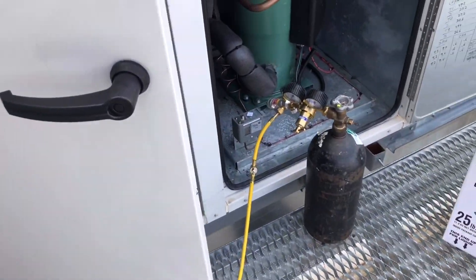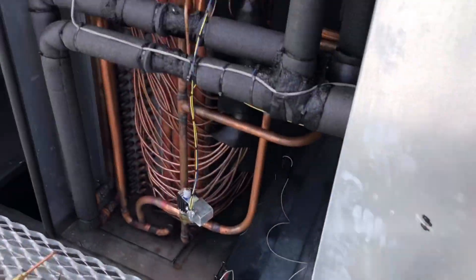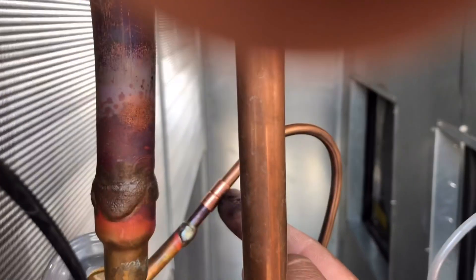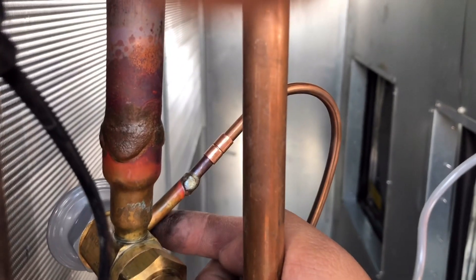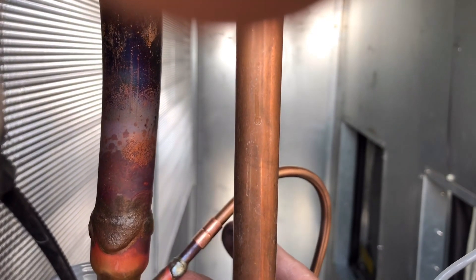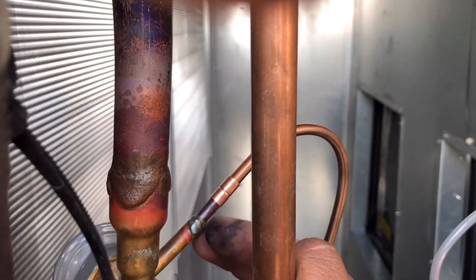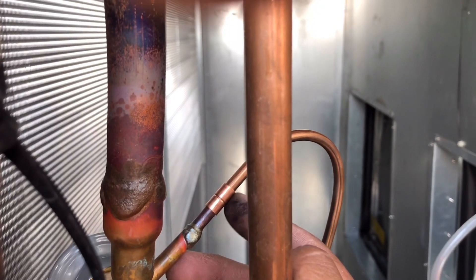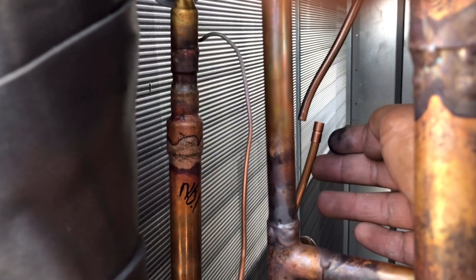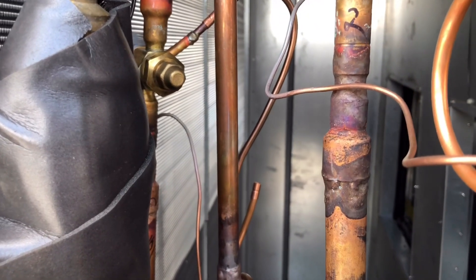Guys, we're back from United. Got all the stuff I needed, so we're ready to braze. We got the nitrogen flowing. I know some of y'all are going to be a little disappointed, but I am going to use a coupling right here because I don't want to mess with this valve. I'm going to put a wet rag around all this and try to braze a little further away. At this point I don't want to mess with this valve at all, so if you guys don't like it, leave a comment. I'm going to braze it up here with a coupling, and I've got another coupling right here — it's going to go right in there. I'll go ahead and braze it, and then we'll do the filter dryer.